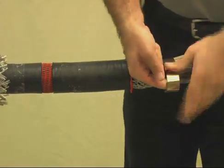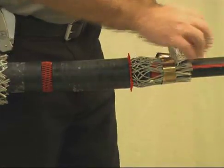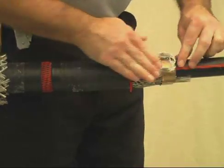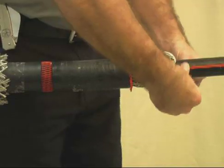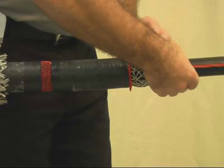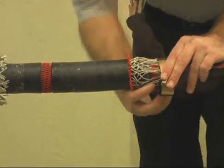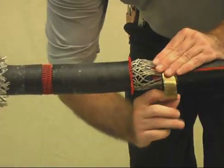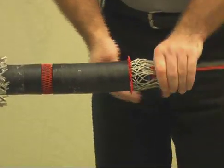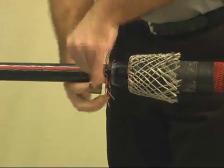Install a G-size spring clamp, apply two turns of the spring clamp, and then fold the neutral sock back into the spring clamp connection. Then apply the rest of the spring clamp. Repeat for the other side of the splice.